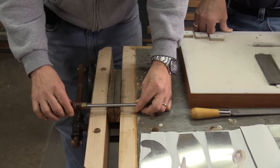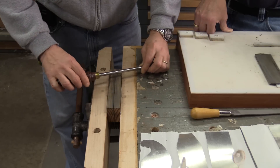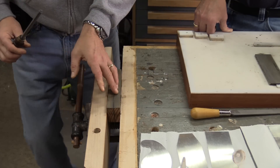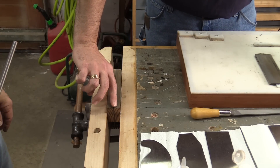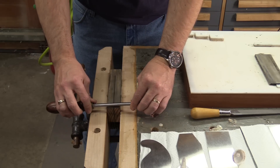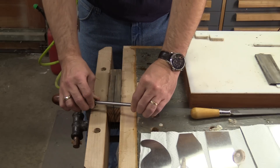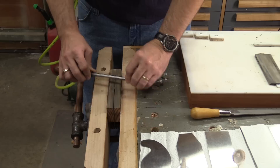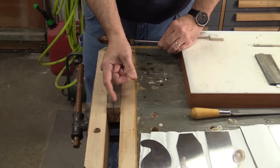Now take the burnishing tool, lay it level, put a little bit of an angle this way and that way, and just draw it across with a very light touch — four or five times. Put your fingers in there. Feel that burr? Yep. You can hear it too. Why don't you give it a try on this side — go straight down a little bit, then just pull it towards you. I found it helps if you drag it. Very light touch. That should be enough. Do you feel the burr? I do. Let's do the other side and we'll give it a test.